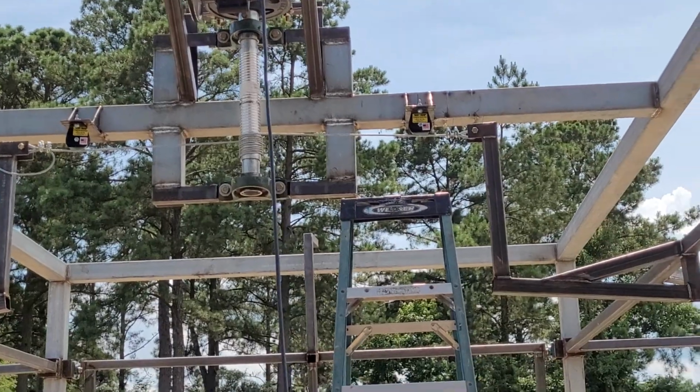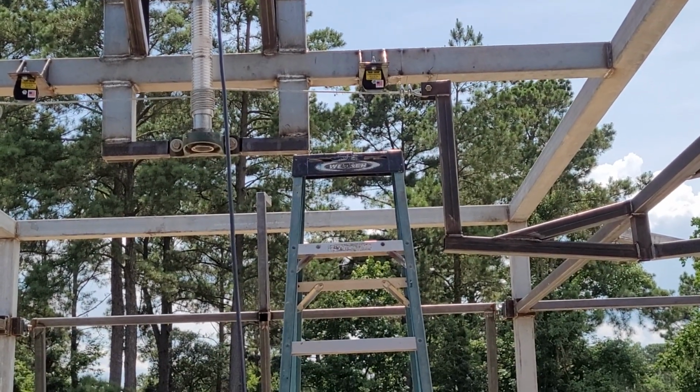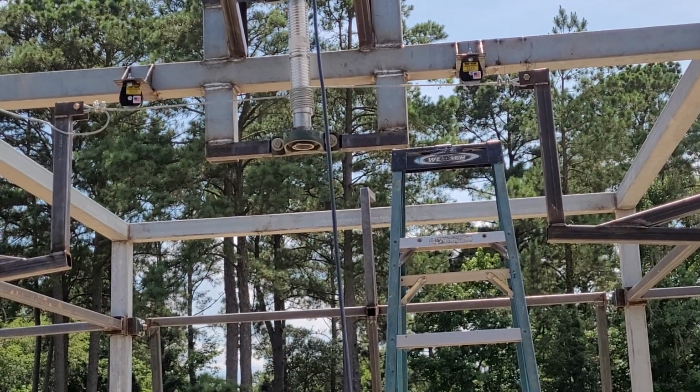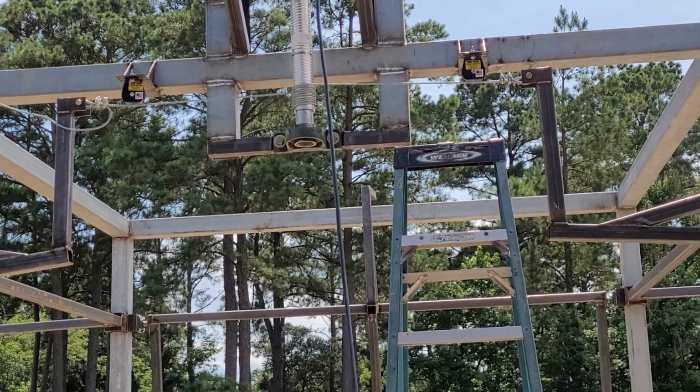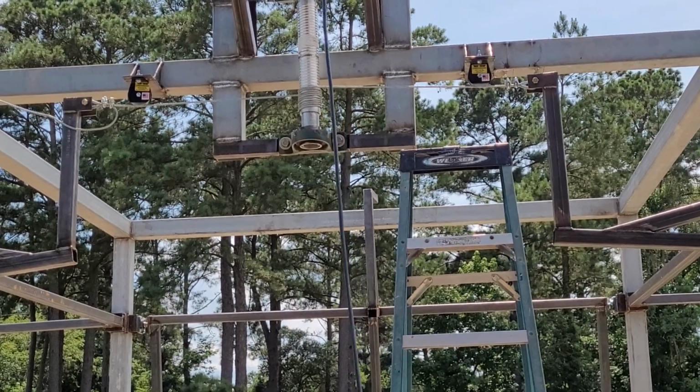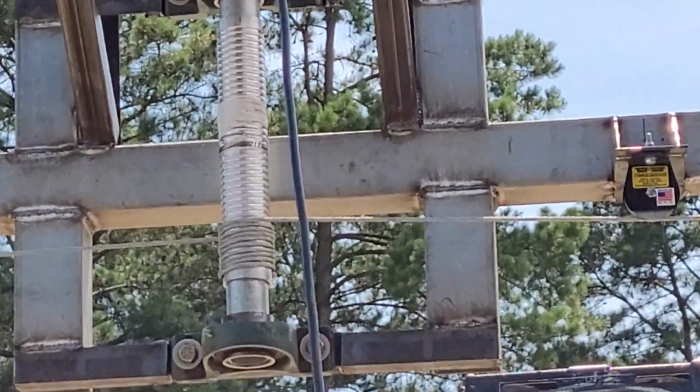the cables are nice and straight. They're no longer sitting on the pulleys. Now those pulleys are rated at 2,000 pounds a piece, and we're not putting near the pressure on it. And that's direct pull up and down 2,000 pounds. So, and it's spooled up pretty nice. I see a little coiling issue, but it's nothing major.